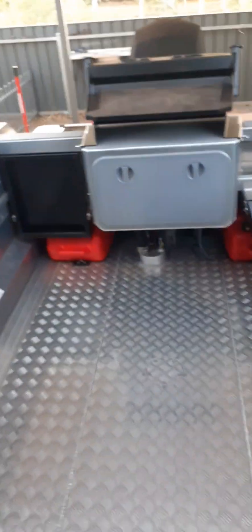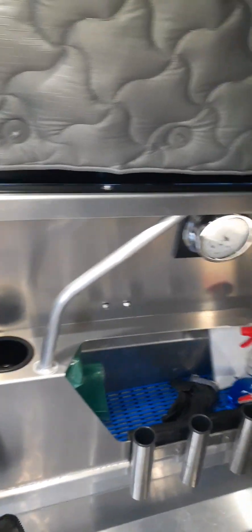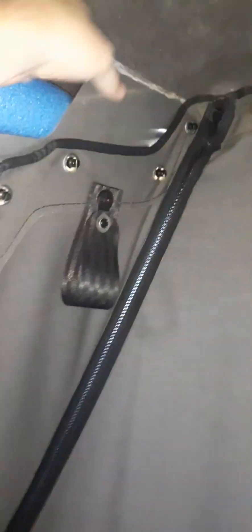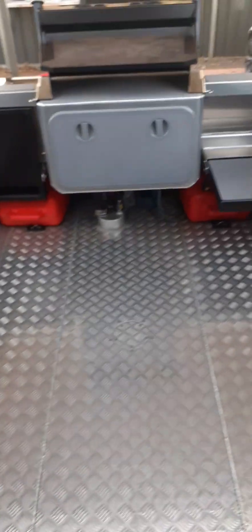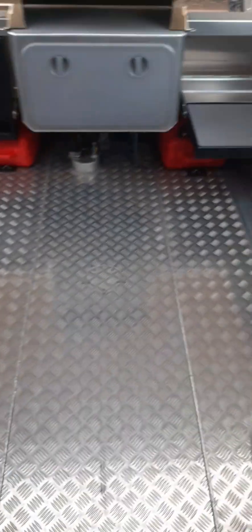I also had contamination issues. Up in the top where they drilled through for the heading sensor there was a broken drill bit sitting inside. It's not likely to cause a major issue there, but if it had worked its way down the pillar where it sits wet, it could have easily burned a hole. There was another one in a gap nearby and bits of copper in the bilge area too — all you need is water sitting there and you'll get a hole. Glad I found those early.